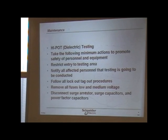Now the breaker is the one that I actually wanted to get to, because the way of thinking of it is the same regardless. You don't want to open this up when all of these are closed. They should have been opened. Maybe this one going down to a lighting panel, you don't open your lighting panel. But if it's a motor, you definitely want to open the motor, especially if it's got a disconnect, because we can take this down to three phases for the motor and the disconnect. It's going to be tied in to the motor itself, where the motor is running.